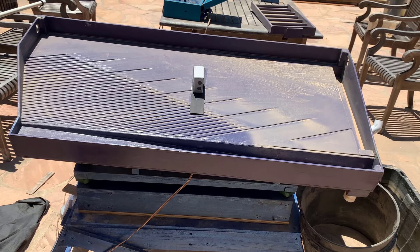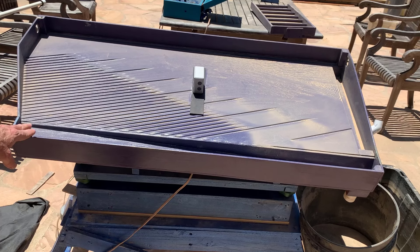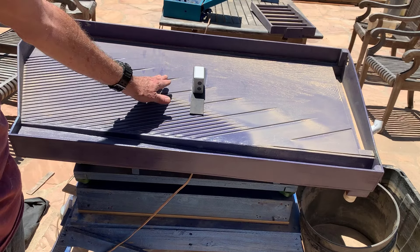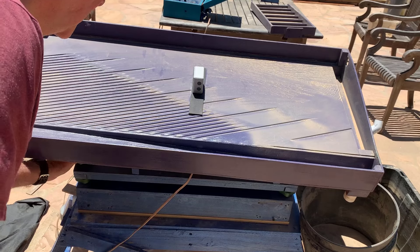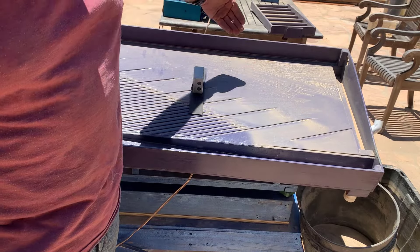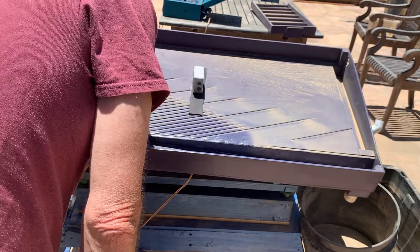This table is a new table I haven't actually shown you — I've had it for a few months and I really like it. It's meant for wet concentration of gold, so it's not for this purpose at all, but I thought I would get it out to see what I can do running it dry. I normally run it at between three and four degrees slope, but now I'm running it at 14.5 degrees, because when it's dry it takes a lot more downward force to move the material I don't want off the table.